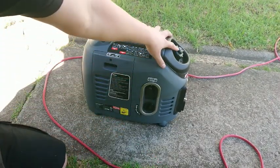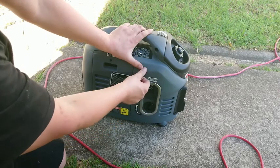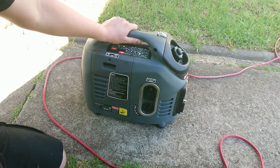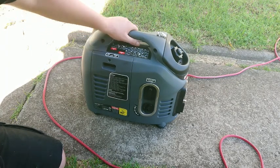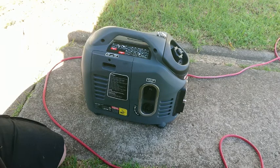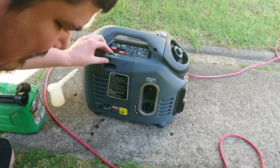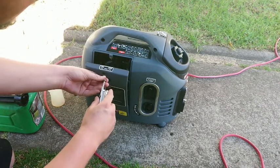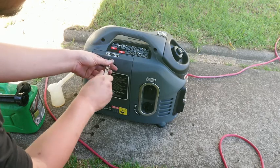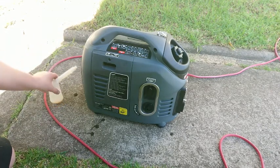I missed a step — there's an air vent on the top of the fuel cap. We've also let the fuel bleed through a little bit. The low oil alarm just went off, so I think we need more oil. After adding another 200ml — not surprising for the first run, it probably sucked some oil back into the system — everything else seems in order. Let's try again.